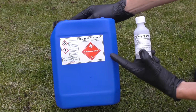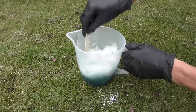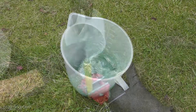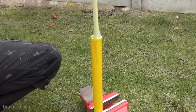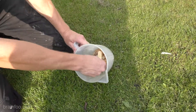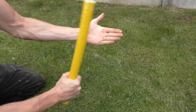This is a cheap polyester resin which I'll mix up at anywhere between one to four percent of catalyst. It's nice and warm so I'll use one percent. With that mixed thoroughly I start adding chopped fiberglass strand — basically just as much as I can while it's still workable. If you've ever seen a bondo-type fiberglass car filler, that's what we're making. With the fiberglass rammed home and topped up fully, we can let it cure. The handle will feel as strong as anything.